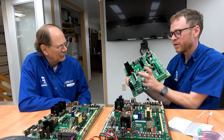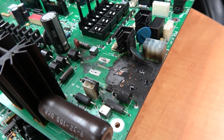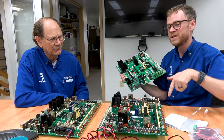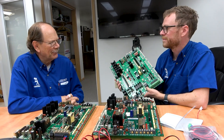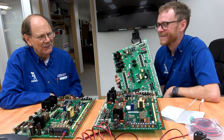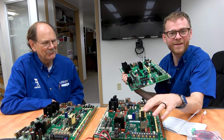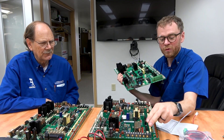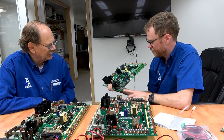If you're going to run a motor contactor for three-phase or single phase, you could run 220 volt — but run a coil, not the motor directly through those relays. You could grab 200 volts AC from the transformer, run it through the dry contact here and fuse it, and have it run the motor contactor — the motor contactor, not the motor. You can't run the motor through these; you'd have to run two, and they're not rated for that. These are not for any kind of load — they're just for signal stuff.